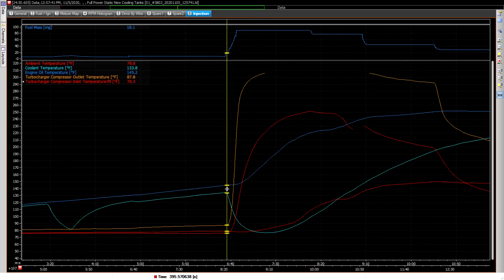I've got three different criteria for where I'm going to back off the power. One is the turbine inlet temperatures — basically the exhaust gas going into the first turbo when that hits a limit. Then the next one is the engine oil temperature, and the last one is the coolant temperature. So those are the things driving my decision on when to actually reduce the power. You can see here at around the 400-second mark, that's where I started the run.